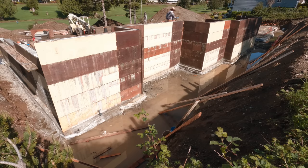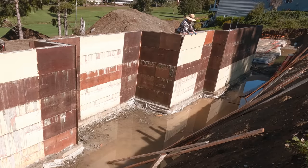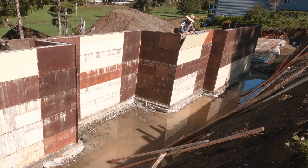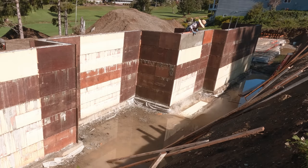Now this is why we leave the scaffolding in place. So just watch. Obviously we have to take panels off from the top down. And I need to pull the grade nails at the same time. Remember those are the little three penny finish nails that were tacked along a snap line that was set with a laser. Also, as I pound on the form, I can get any concrete that's on top of the form just to come right off and then I don't have to scrape it later. Or if it's a little stubborn, I just use my hammer and I scrape the top of it while I'm there. Just try to do everything to that panel I can before I let go.